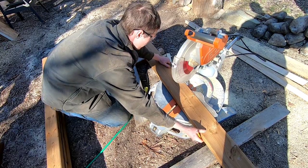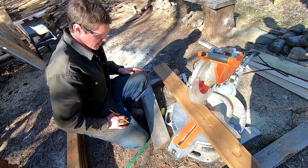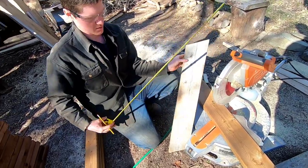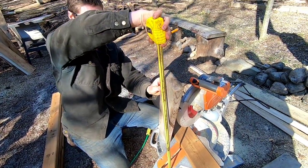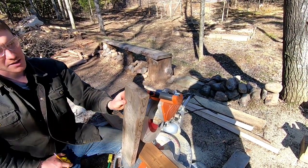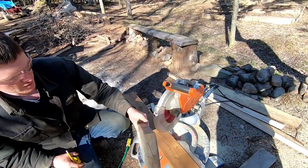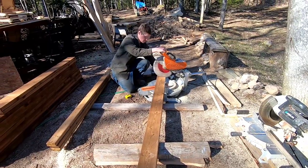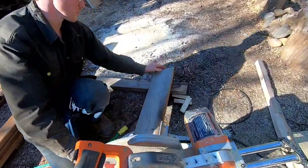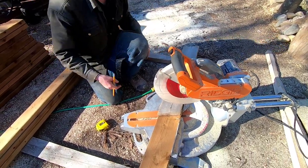It took a lot of math to get everything right the first time. The length is 31 inches; the total height should be about 28.5 inches when standing upright, which gives us approximately a 30-inch table height once you add the top. What I do is mark the first piece just a little bit oversized, then once I cut that I turn it around and remark it so that all pieces work out to the same length.